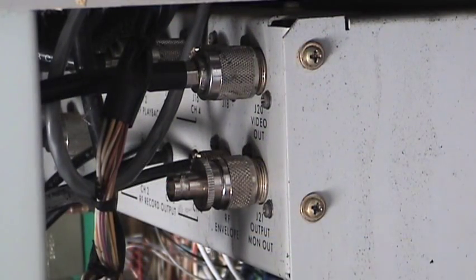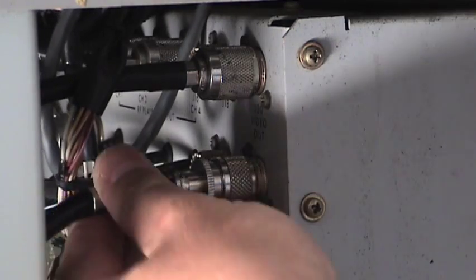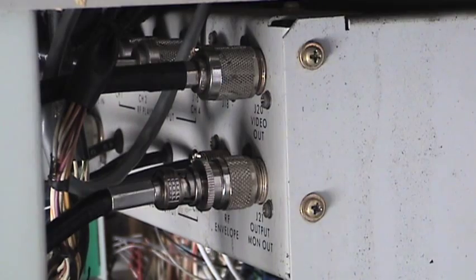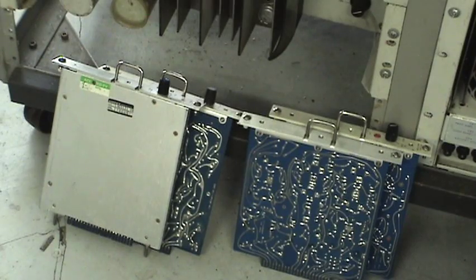Let's look at the signal system. I'll connect video directly to the output of the signal system, so I'm just looking at that portion of the machine. Four cards were bad in that section, and we had still a problem with the demodulator. As we apply power to the machine, that card is slowly coming to life. There were some bad capacitors and bad transistors on that card.